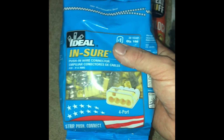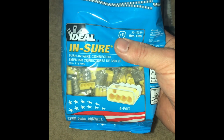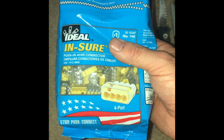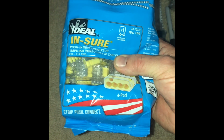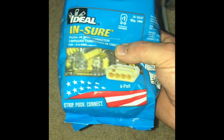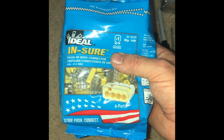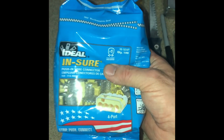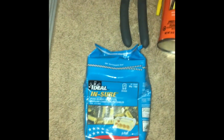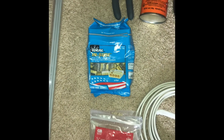This is for the NM stuff. And then I've got these guys here. It's very controversial. Most electricians will curse me for using these things, but I really do like them. I've used them in a few other things, and not just my choice, but stuff that has come with direct wire equipment. These guys are coming with pretty much everything now. Makes connecting all of the different 14 or 12 gauge, you know, the 12.2, 14.2, 14.3 wires, super easy. Dealing with 12.2 and 12.3 is insanely difficult, so that just makes it really nice rather than trying to tie everything together with wire nuts.